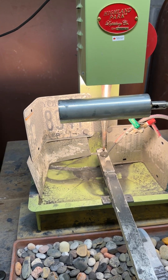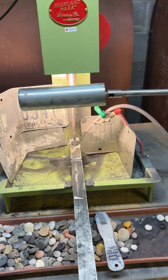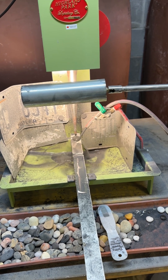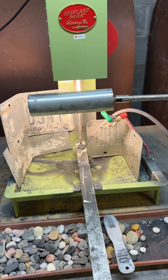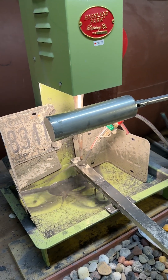I use the super easy solder — the silver solder. I tried the harder ones and it seems to be too much heat and it cracked the tube. So far the silver solder has been the best for me. I did not buy the tips from Highland Park — it was a little too pricey for me — but you can try.